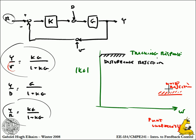It's fairly easy for me to model the first fundamental modes of the plant that are at lower frequency. When I start getting into how the telescope is flexing in its mounts, those are starting to get hard to model. And so I'm going to take my best guess, but the truth is I might be wrong. And those are all going to show up at higher and higher frequency. So the fact of the matter is, if I just slam them all down at high frequency, it doesn't really matter if I'm wrong or not. They're gone. The slope at which I come through here gives me my stability, as it turns out. And we will get to that once we get to Bode.